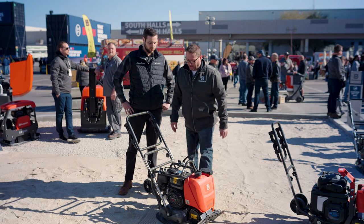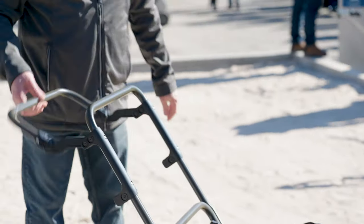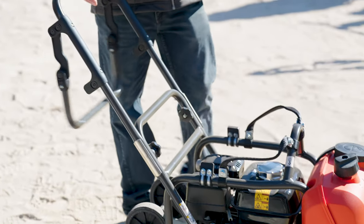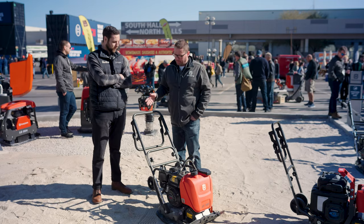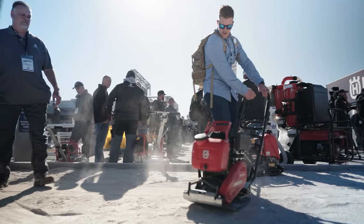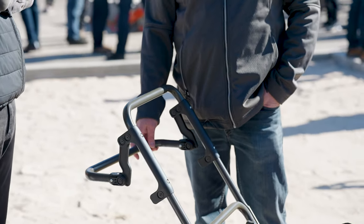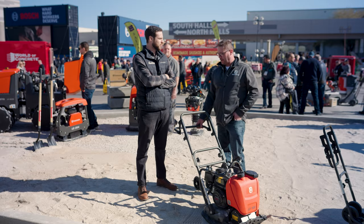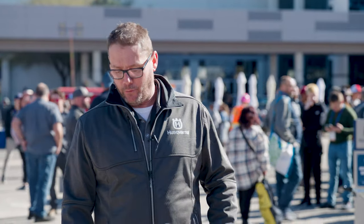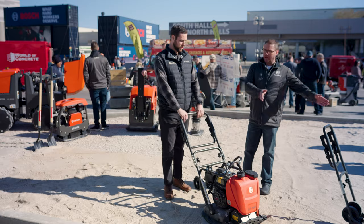The last thing I'll say about it is the unique handle everybody sees on the back of these things. They look like plastic because there are some forms of plastic, but you'll notice that all of the standards in the US and Europe — Europe has an extreme vibration law and it's starting to gain a lot of momentum here too — all the vibration comes from the handle right here on the operator. This little swing handle and these little plastic grommets reduce the vibration down to almost nothing. There are some situations where you can only run these for an hour or two, but by using one of these you can pretty much run them almost an eight-hour shift. We are on year 12 — this was an Atlas Copco version before this — and we have not seen one of these break yet.